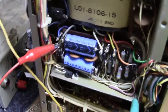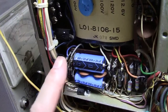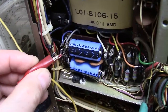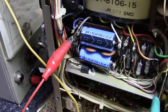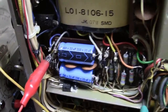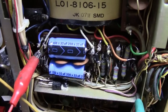If you look at where this red clip lead is right here, this is where the low voltage AC comes in. It's rectified here, and on these red wires what you get is about 14 volts DC. That goes to power all these stages — the receiver stages of your TS-820. To get this thing to work, all you need is to supply about 1 amp anywhere from 12 to 14 volts DC.